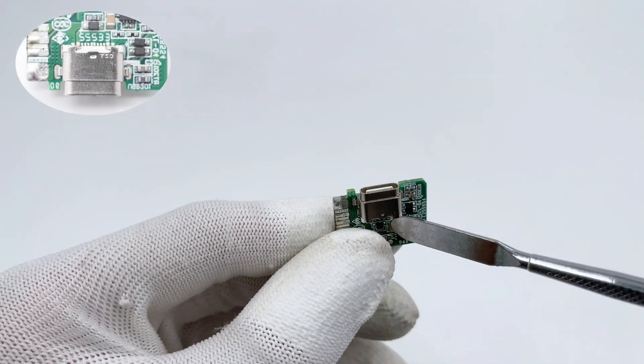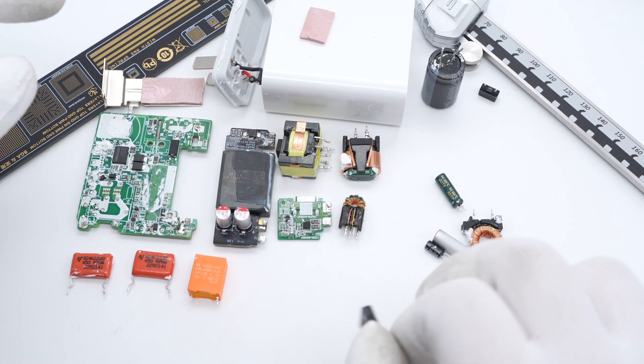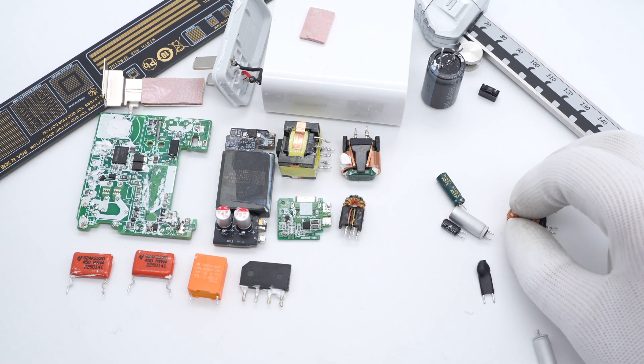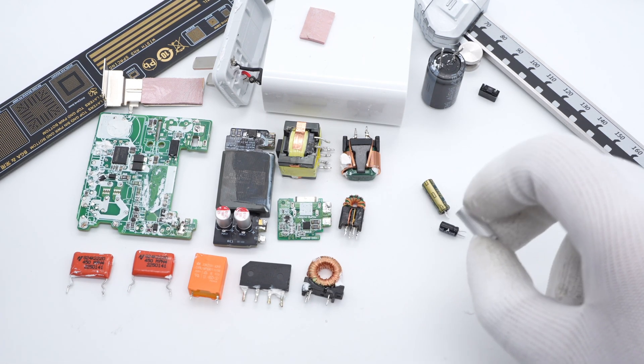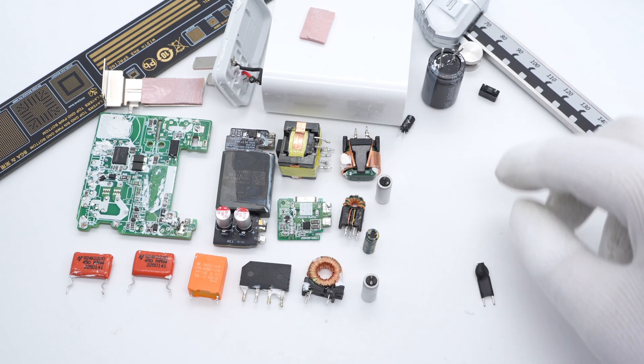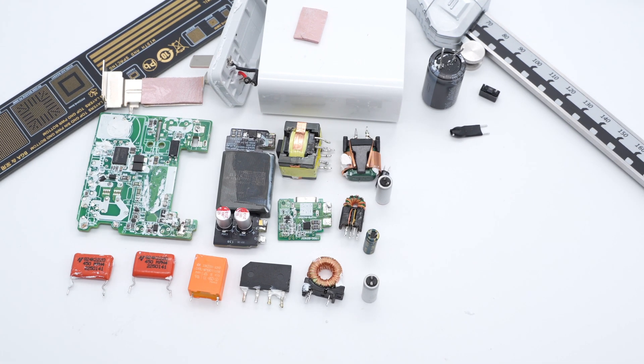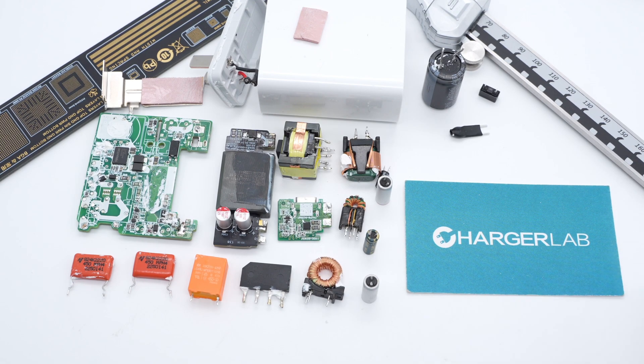Finally, let's take a closer look at the USB-C socket. That's all the components of this IQOO 200W GaN charger. The size is slightly larger than the IQOO 120W GaN charger, but the power density is significantly improved. It supports 200W ultra-fast charging for the IQOO 10 Pro, but for other PD devices the output can only be up to 65W. It adopts ZVS flyback topology and has a PFC circuit with Navitas GaN ICs for higher integration. That's all for today's video — please drop a like, leave your comments, and subscribe. See you in the next video!